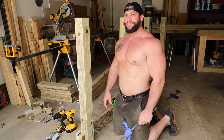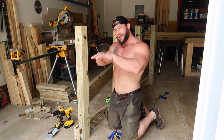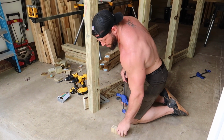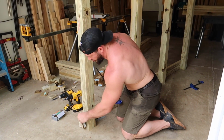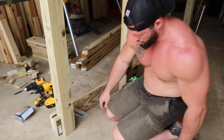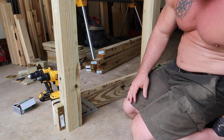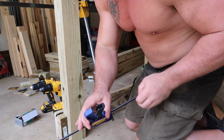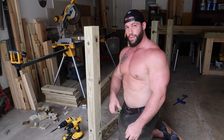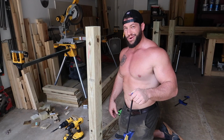Okay, perfect. Alright, so we're down working on the floor because basically that's going to set the top level of our post with that 2x6 in the front. I'm going to pile this up here with a piece of 2x6 up. It's going to butt up against it. So I'm spacing this with a scrap piece off the edge instead of measuring because it's more accurate. And then I've got a square here. I want to make sure our post is square to our board here. And we'll clamp it together. Then I'm going to countersink, drill a bit in, and put a deck screw in and fasten these one by one. Probably one for now so we can get it level and then get everything straight, and we'll tighten everything up with 3 more screws probably on the back end.